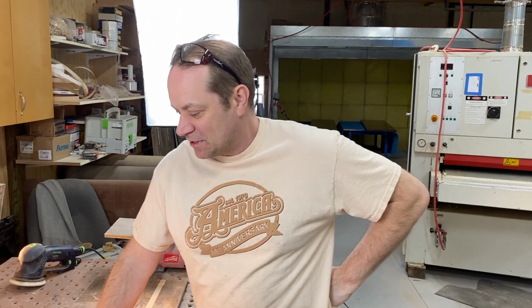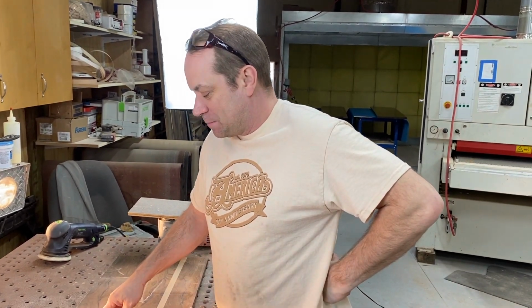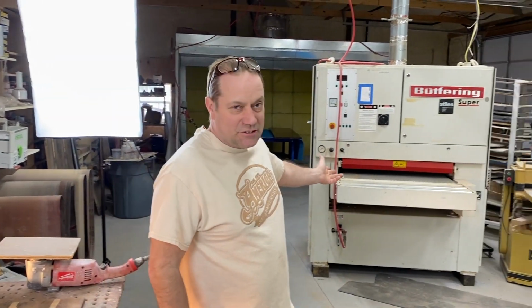All right, today's video we're going to be discussing how to remove veneer tape and do your first sanding on a veneered panel, because this tape is kind of a pain in the ass to get off. There's several different methods to use. The easiest and fastest is to run it through a wide belt sander, but it's also the most dangerous to where you can burn through your veneer fairly quickly.